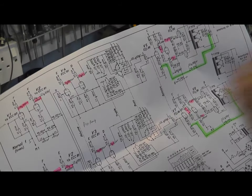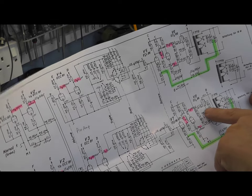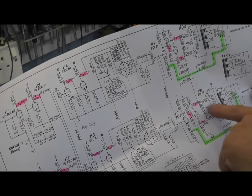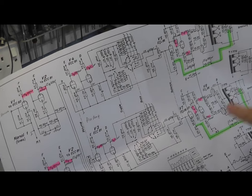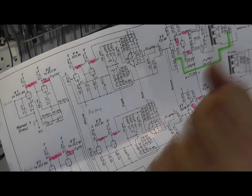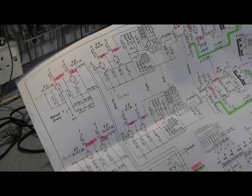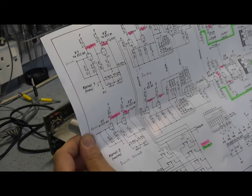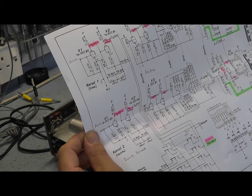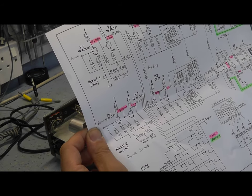I've gone through all the capacitors in the output stage and everything looks fine. No heavy biasing on any of the grids. The grids are only maybe a few volts above the cathode, no more than that. So that suggests that the amplifier is biased on, but not excessively. Nothing appears to be getting hot, obviously apart from the valves, so that all looks good as well. The preamplifier looks similarly okay. Those mustard caps are very reliable, as I said before, and they seem to be okay now.